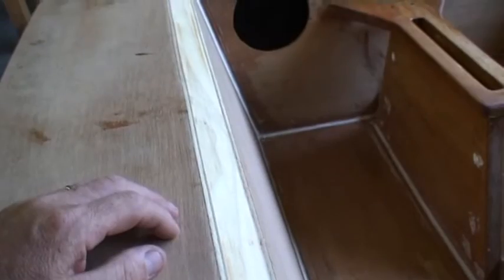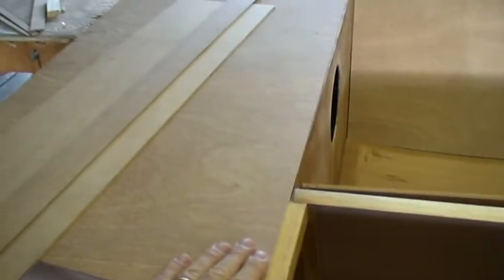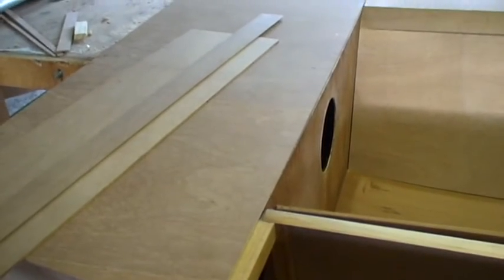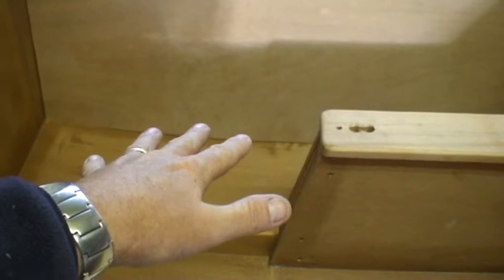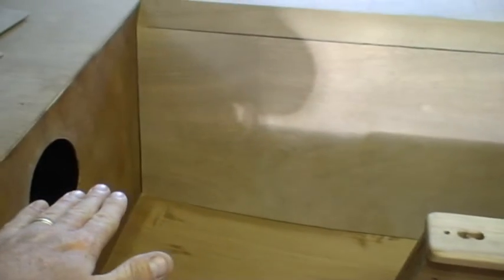So step by step, this is how we fit these pieces together. First of all I put the rear deck in place, and this can either be glued or just temporarily stapled into a fixed position so we know where it is. We can then do these cockpit sides. The plywood just needs to be cut to length, we slot it down into our cockpit, and we use a bit of wood with a pencil just to run through and describe the curve on the bottom of the cockpit side, which can then be cut.